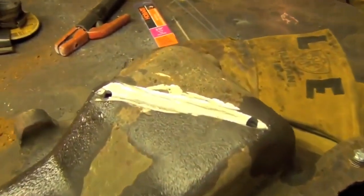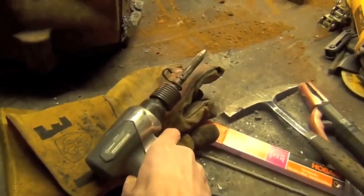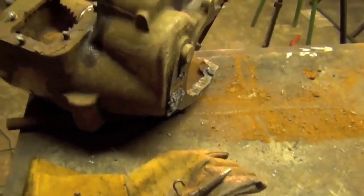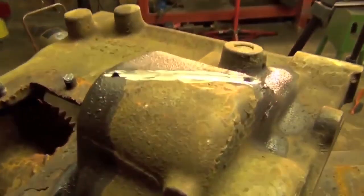When I say little welds, I mean like half an inch or three quarters of an inch - definitely not a full inch. These are definitely going to be some small welds. In between these welds we're going to let the casting completely cool - shouldn't take long because it's really freaking cold out here. Regardless, this is how we're going to control heat input and hopefully avoid any potential cracking issues. One other thing: as soon as you get done with the welds, you're going to want to peen it immediately. That basically means taking a slag chipping hammer and beating the crap out of it, or if you want to go high-tech redneck, you can buy a $20 air hammer from Lowe's. The reason we're going to peen this weld is - imagine your weld bead as it cools, it's being pulled in all directions, and if you hammer on it, you're going to push it out a little bit and that's going to work to relieve stress. So let's demonstrate and make our first weld.